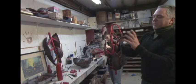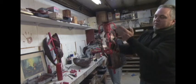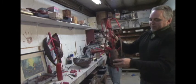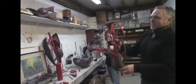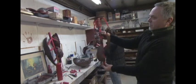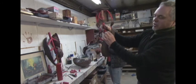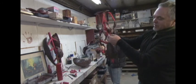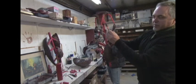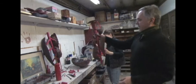About half an hour later when it cools — and we may cool it with water or by throwing it in the snow — we can carefully knock off that mould and see how our casting has come out, to perfection once again. Once this is all turned to metal, which is what literally happens, we'll carefully remove each of these little sprues and vents so that the original form is maintained, and then Yuri will take them over to do his magic on.